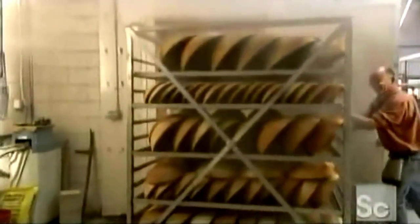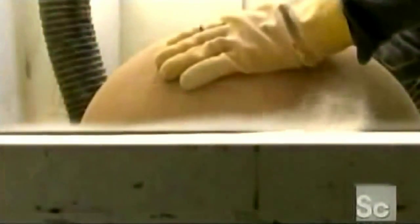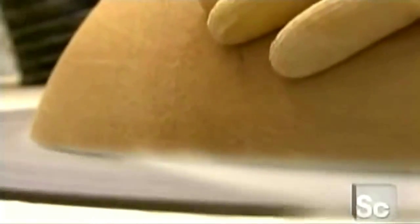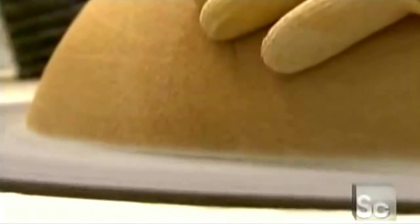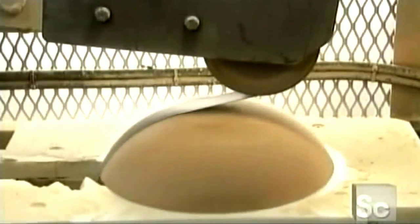The bowls are steamed for about 4 hours to draw out the sap and hydrate the pores of the wood uniformly. Once a bowl is dry, about a month later, workers even out the top rim on a sanding table. Then, using a belt sander, they smooth the outside and inside surfaces.